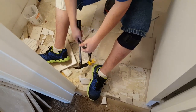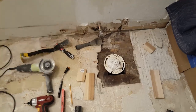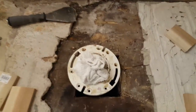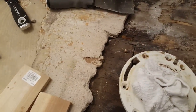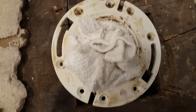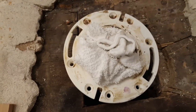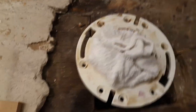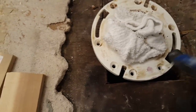Protect your eyes please. We're looking at the toilet flange we just dug up after removing the old tiles. They tiled over linoleum and several layers of it. The bigger problem is there was only one screw in this toilet flange — a very common problem. You can see all of these screw holes; there are supposed to be four screws at minimum holding this thing down.